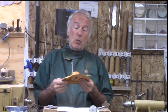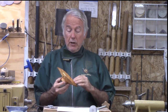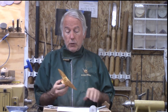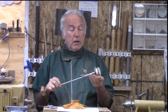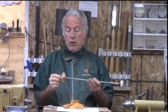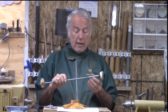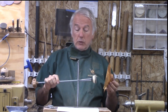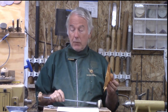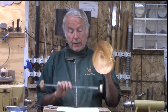Then I let it dry for a week, but that means you have a warped surface. It is impossible, really, to put it back on the lathe and to turn it and to sand it. So instead, I used a Morse Taper collet with my sanding pad on it, and a drawbar that goes through my headstock. I sanded it here — that gave me access around this way without having to hold a drill. If you are using a drill, you have to secure it somehow or use your drill press. Both of those would work well, but I like this way.